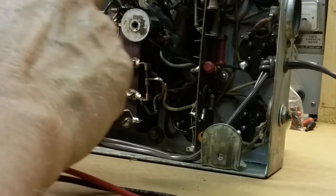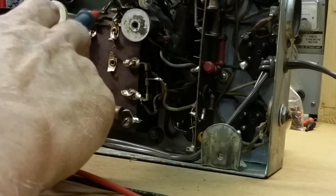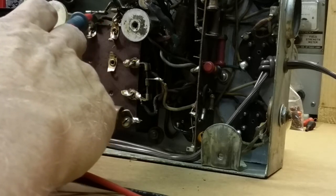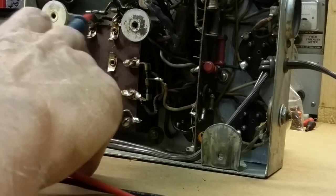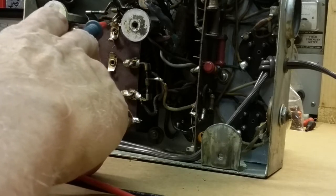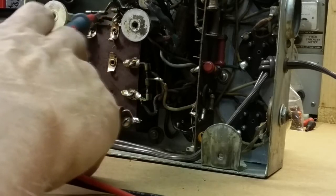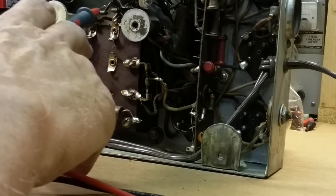We have a problem twofold. One, the center tap is not straight out at 90 degrees, which means there's some issue there. But we already know what the issue is because we can see it here. We have the missing insulator that went through the coil, like on here, here, and here. The insulator's missing. All we have is the coil, and so we have this coil wire here dangling in free space. Whether or not it's connected here remains to be seen, but it's not wrapped around its centerpiece, the insulator. That doesn't matter so much if it's still connected.